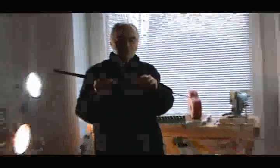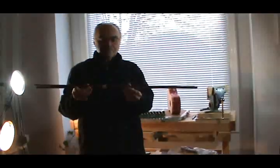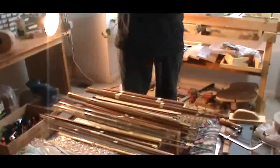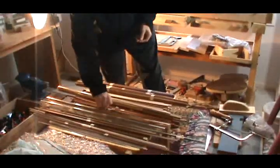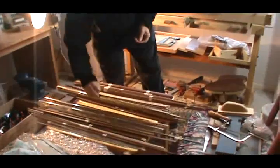And here's more samples. I've got some Southeast Asian rosewood, which is really thin. It's about 1 millimeter, about a 25th of an inch by about 6 millimeters, 1/4 inch by about 20 inches long. And similarly, I've got a whole bunch of other woods here that I've used. Here's strips of Ipe, Brazilian walnut, quarter sawn Pernambuco, and dyed pear wood, local pear wood from the backyard here, from a pear wood tree. Sycamore can be used, more Pernambuco.